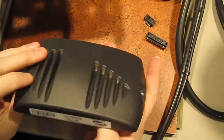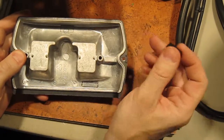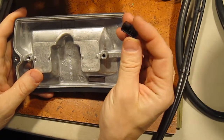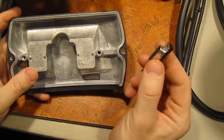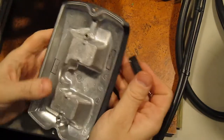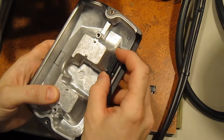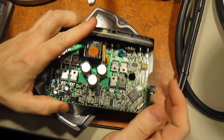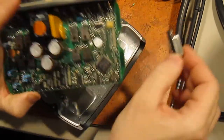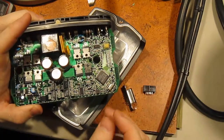I'm looking at options for setting up a connector. I was initially thinking a 10-pin header would work since I need two pins for each of the H-bridge driver chips plus power and ground. However, I forgot about the relay which also needs to be engaged, so I opted for a 15-pin connector. Instead of placing it at the top, I'll put it here where there's more space and it doesn't contend with other things on the board. That also allows for a longer lead, so if I have to take it apart it's easier and won't break wires.